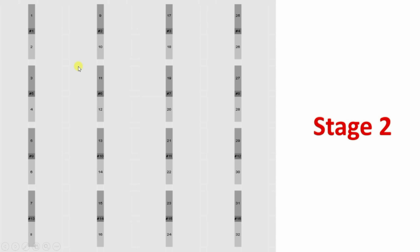Now what will happen? Now next step, what do we want to do? We want to draw one square. So for that square, this arm will be rotated 270 degrees. So it will travel 180 degrees and 270 here. Similarly, this will travel for 270 degrees. So it will go from here to here.